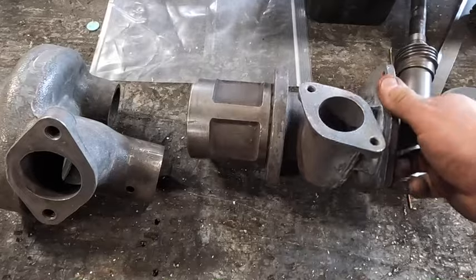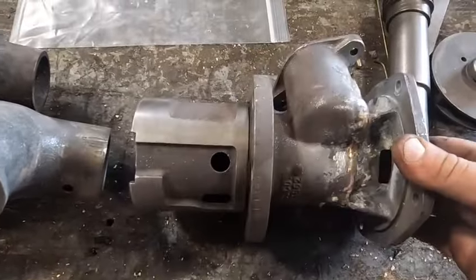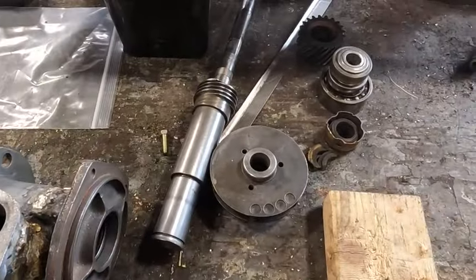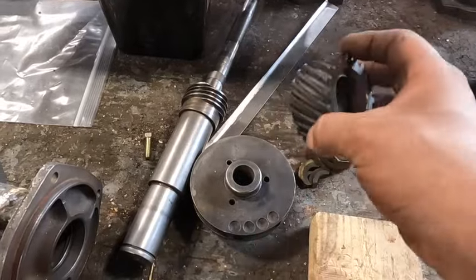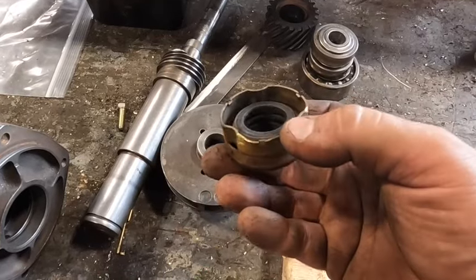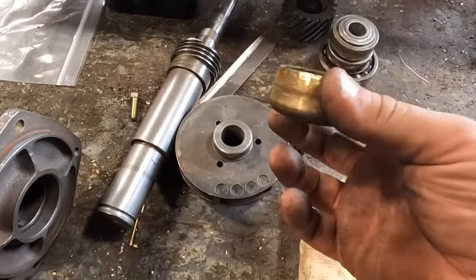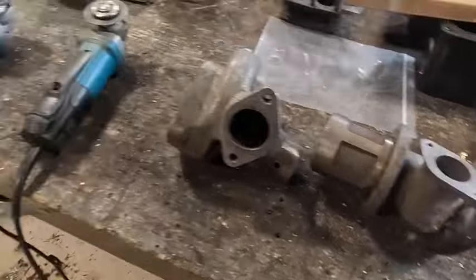This is the Maxim water pump housing and it came out really nice — brazed it up and ground it down. We're waiting on some parts to put this together. Did a couple of repairs on the shaft, and we actually have a new old stock Hercules gear coming in — I couldn't believe the guy had a brand new one. We've got a couple of new seals right here — carbon spring-loaded carbon seals. This is how your water pump seal works on the later water pumps. Really nice technology, advanced compared to packing, so you don't have to bother with a packing nut.